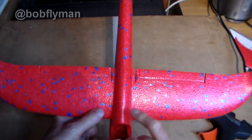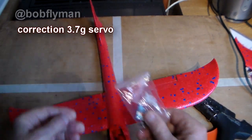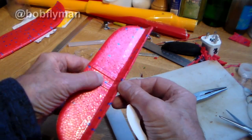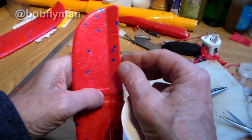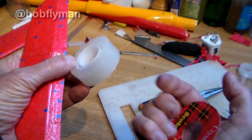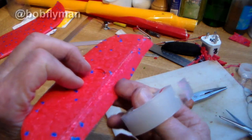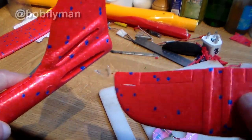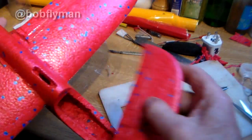I've used the hot wire to cut a little bit further into that orifice through where the wing is, and then I'm going to fit a two gram servo to operate the ailerons. Before I do that I'm going to make the elevator. It's pretty thin here — almost impossible to make a shallow cut without going right through — but a bit of Scotch crystal tape along the join and it's fine. I've got to put that through the slot and make a cutaway at the back.